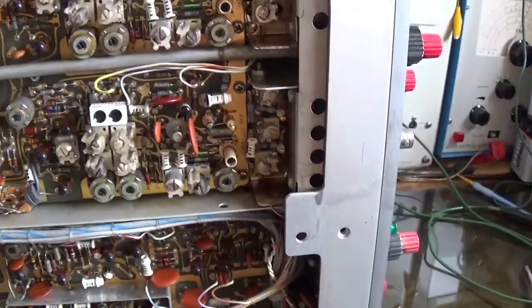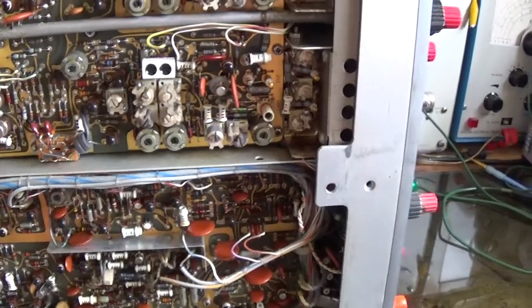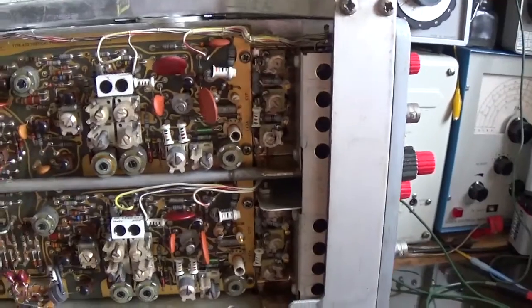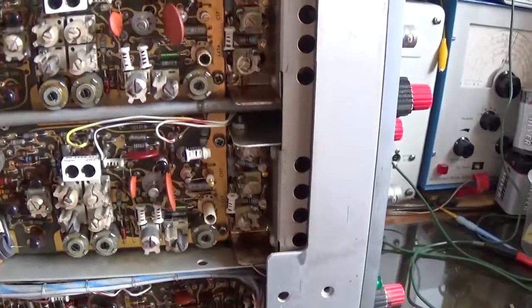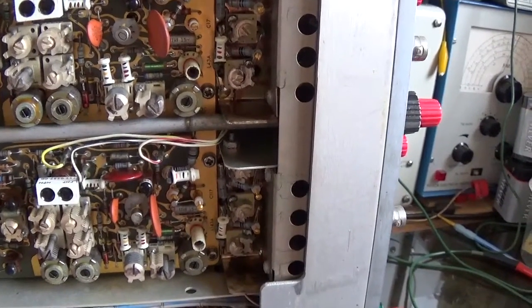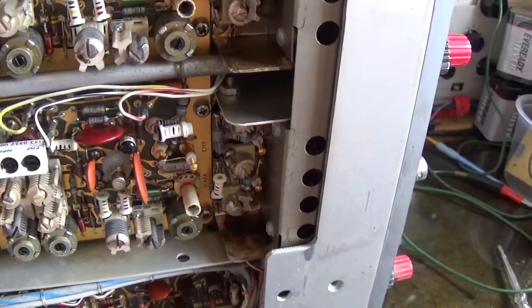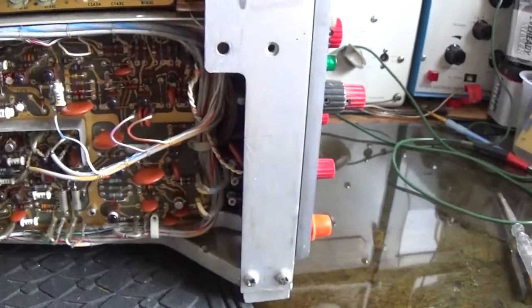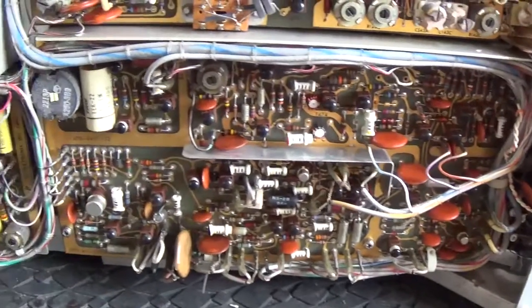What's this? Vertical preamp. Oh, it's just beautiful. What are these? Two transistors — one's got PNP and one's got NPN, in a single package. Now, I've heard that one problem with these — there are obviously several problems — but one thing to watch out for is the power supply.